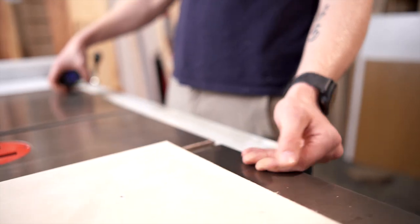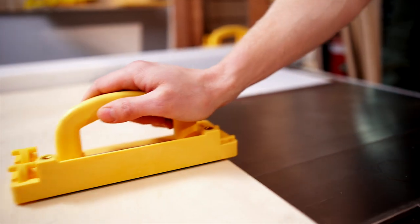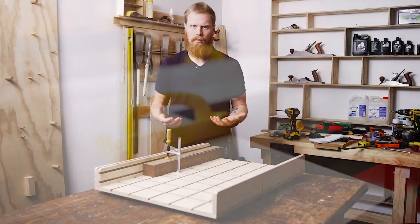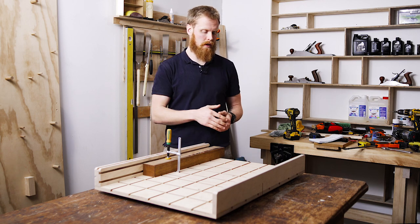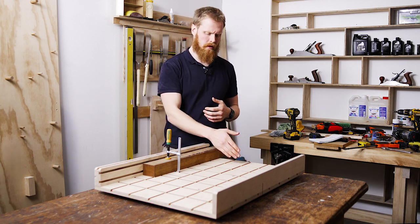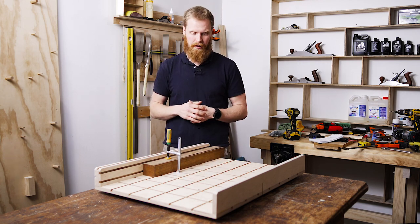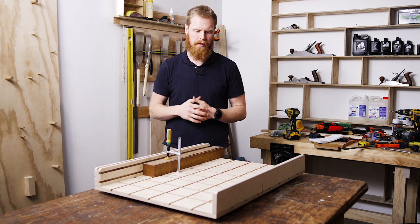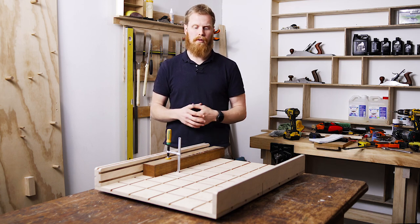Now you want to keep these things simple. So the footprint for our one is 600 deep by 800 long overall. Again, you can make it as long, you can make it as short, as narrow, or as wide as you like. But having it at increments of 100 really just makes it an easier, less stress on you while you are trying to work out what you're doing. So all the increments through here are 100 mil as well. So you've got 800 long, so you've got seven increments of 1, 2, 3, 4, 5, 6, 7. Just had to check that. You've got seven increments across, so seven spots that you can chuck in at least seven clamps along the grain if you really need to secure your work to the sled itself, and then five going from front to back. So you've got a lot of utilization there.